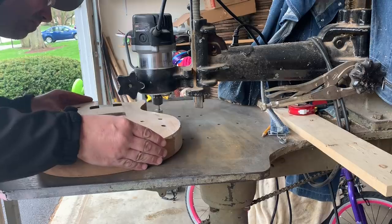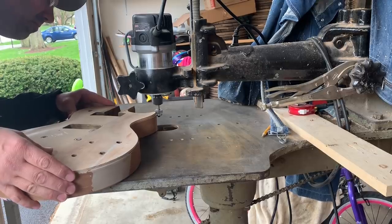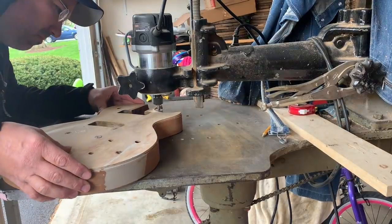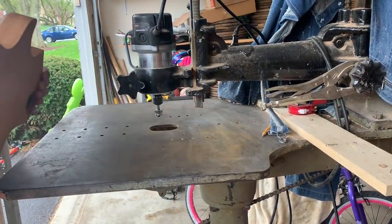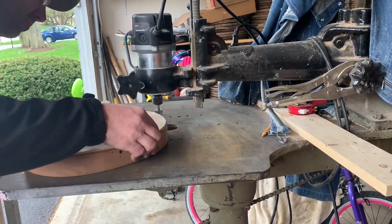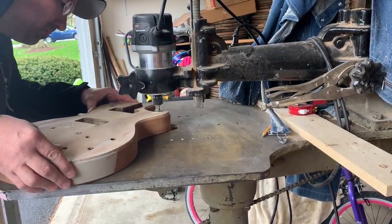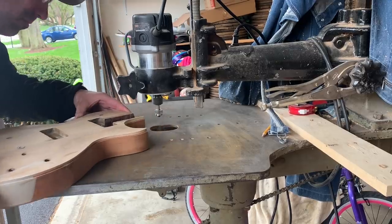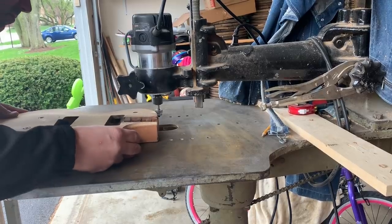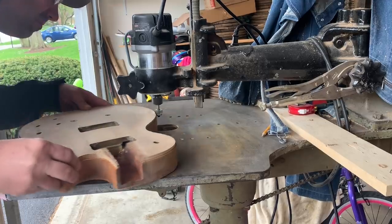The process for this is to just go slow, and around the edges go slower. Specifically that horn can be a little bit of a pain. We'll route that out and make sure it looks good. It didn't look right so we're just gonna pass through one more time. Sometimes when you're routing the body has just a slight wobble, so we make sure it looks right even across the whole body. That's how we do the second pass.